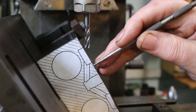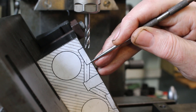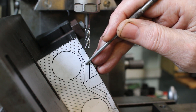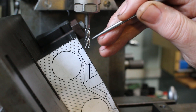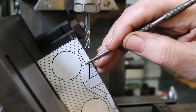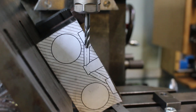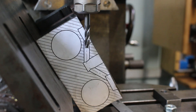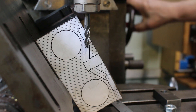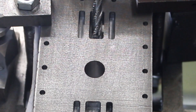I'm going to drill this passage six millimeters diameter. As you can see in the drawing there isn't a flat surface to start the drill, so I'm going to go in with an end mill as a face cutting end mill, just to put a flat surface on and then follow up with the drill. I'm just going to use the drawing as my guide - just eyeballing, getting it near the center. I think we're set.